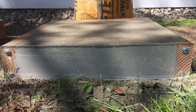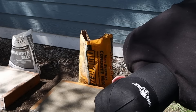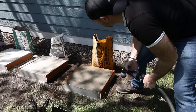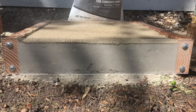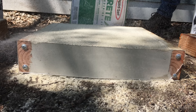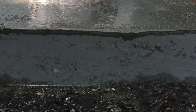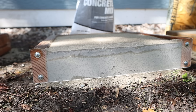We're going to start by misting the Quikrete. That's like two good mistings — it doesn't soak down very far. Let's move on to the Mastercraft, the Menards brand. And now RapidSet's Portland base, 24-6. They all got their first misting. Each one of them soaked up the water anywhere from a quarter inch to a half inch to three quarters of an inch.